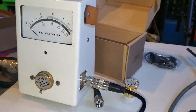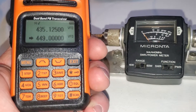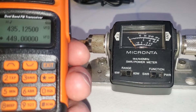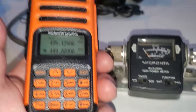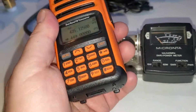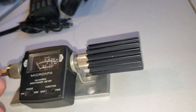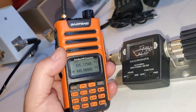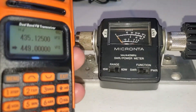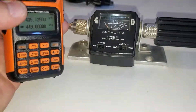We tried to test it with this and the 100 watt scale is just too much — you're not going to get enough resolution. I don't remember what they advertised, I think they said 8 watts. So we're seeing about 5. I saw other videos where Jason tested one of these and it said 18 watts or something crazy, and it was like 4 or 5, just like this one. I don't know why they can't just be honest with the numbers. You'll get about 4 or 5 watts out of this on both bands. Thanks for watching the video, guys.